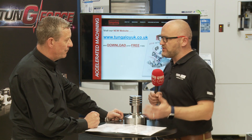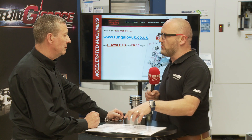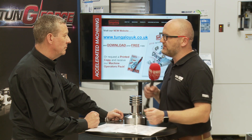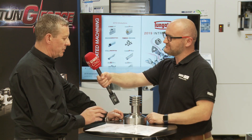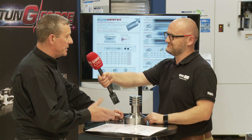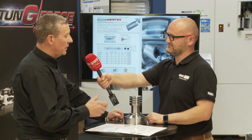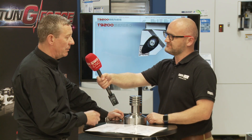There is an argument — I know engineers wouldn't — but there is an argument to suggest you should buy this regardless of how deep the bore is, because you'll get superior finish, superior tool life presumably. Yeah, you could argue that, but I think it's more horses for courses. Somebody doing a three times D bore, use a standard steel bar — let's be sensible. This is aimed at deep boring where you want superb finishes. Combined with the new grades we have, or with something like a Cermet insert, you are going to get extremely good surface finishing.